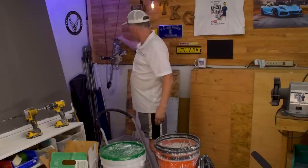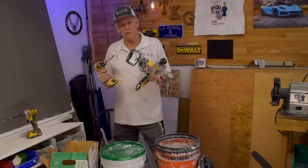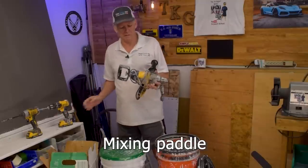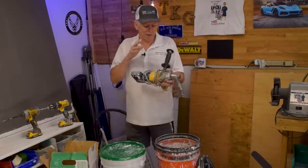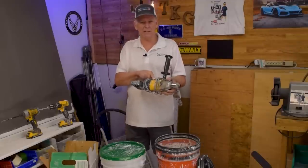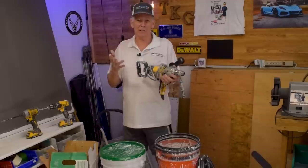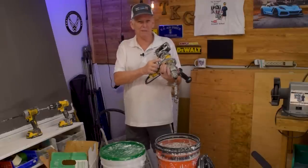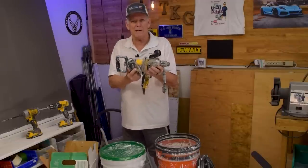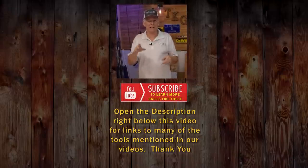When you're going to use a large mixer, you need a big drill. I've tried with smaller ones — you'll burn it up. All that mud on there is from this egg beater, not from the big drill. You need a drill that turns around 600 RPMs or so with plenty of power — I'll put the link in the description so you can compare the specs. There are some cheaper versions that would work for occasional use, but as a pro you pretty much want something you won't have to replace. A drill like this should last 10, 15, or 20 years depending on how much you're mixing.